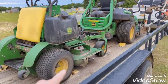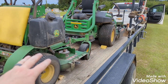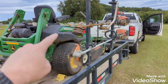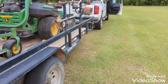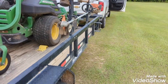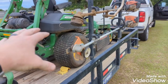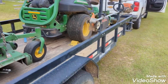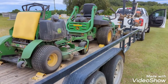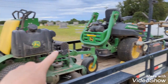So you have a lighter mower, more horsepower, a smaller deck, which means you're not handling as much grass, and faster blade tip speed versus this mower with a larger deck. As far as width, not much, but it is wider. The blade tip speed is lower, the horsepower is a little less, and the mower weighs 300 pounds more. Now I understand the weight probably keeps it closer to the ground as it's mowing, so I get that part of it. But on a relatively even run of ground, especially through stuff like Bahia, it seems that the Z-Track cuts better than the Quick Track.